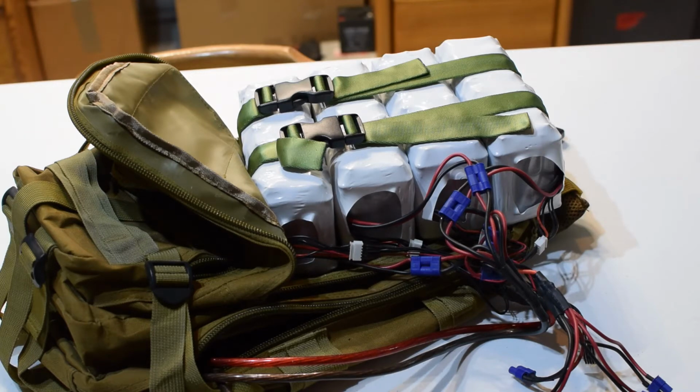And then I did have this going in parallel into an 8 gauge wire, and I had this hooked up to a little inverter. It's a Xantrex Pro Watt pure sine wave 600 watt inverter that would stuff into the backpack as well, so I could grab and go and run some AC power, small power items. I don't use this pack a whole lot. Every now and then the power will go out in the house for an hour or so, and I can plug in a lamp and that kind of thing. Not a whole lot of use, but it does come in handy.